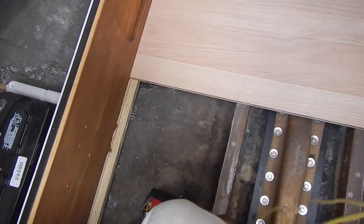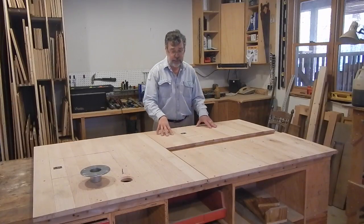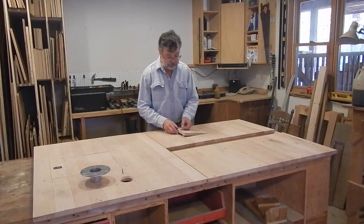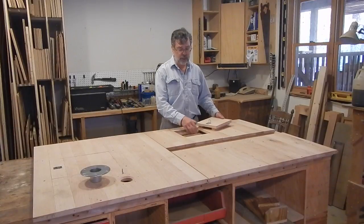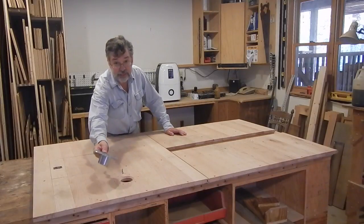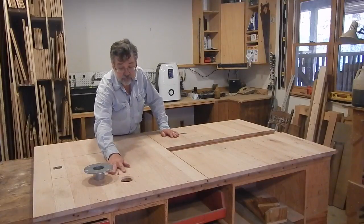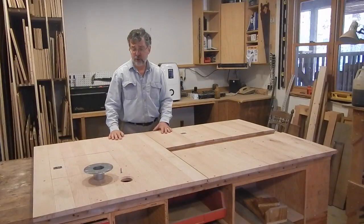Alright, so we have to go on and do the side pieces, which will be much of the same, and I probably won't cover in much detail. So assembly of the aft sections of flooring is now also complete. The starboard section here features another access panel. I plan to install a depth, speed, and water temperature instrument in this area, and that will provide access for that. We've also made the cutout to receive the table leg socket and the bolt holes for that. Those will get tapped with the 1/4-20 thread at the very end.